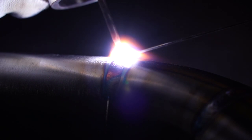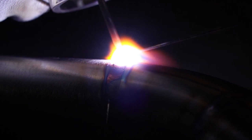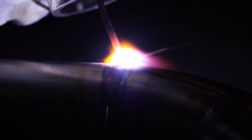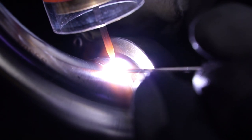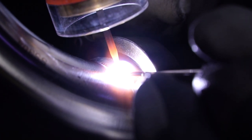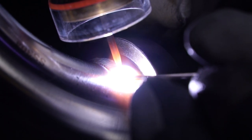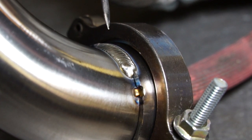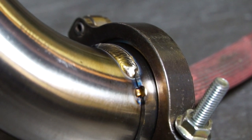Now with all that out of the way, let's get down to business. Travel speed and heat input have a lot to do with your weld's aesthetics. Too much amperage and not fast enough travel speed results in a fiery mess of nastiness — it's all about balance. Welds exposed to atmosphere at certain temperatures will oxidize and turn different colors. The goal is to always weld with just enough amperage to penetrate, but don't overdo it because extra heat is unnecessary. When your post flow stops, you want your weld to be at a temperature that will leave acceptable oxidation, not overheated in gray or black — that's bad. Torch angle factors into this especially around tube or pipe, but let's save that for another video.